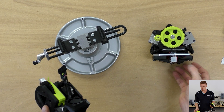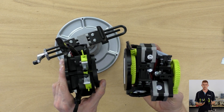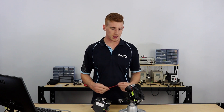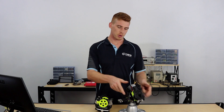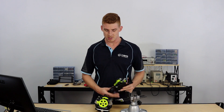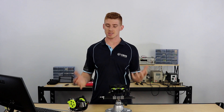That's given it quite a cool look and made it wider but not deeper, so the V3 tool head is quite thin compared to the V2 — about 120mm versus 75mm with the dual extruder, so quite thin comparatively. Another similarity is that 0.5mm hot ends are used on both the V2 and V3. Similarly, both tool heads use the direct drive extrusion system with separate motors mounted to the tool head pushing filament down into the extruder. You will notice though a massive difference between the Wade-style extruder on the V2 and the new aluminium idler system on the V3.